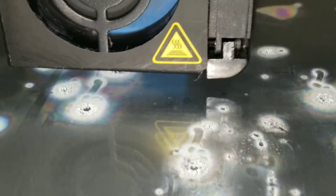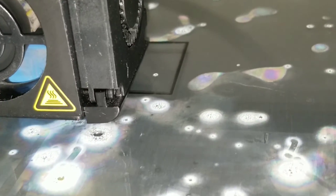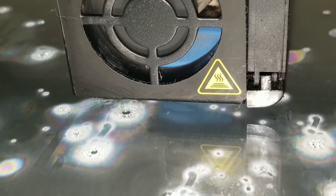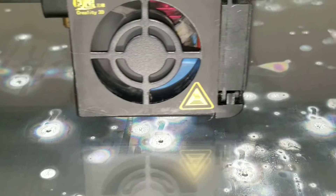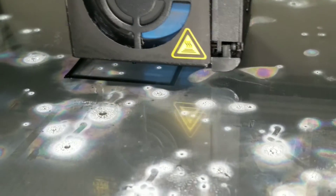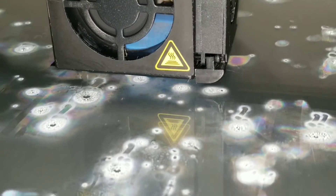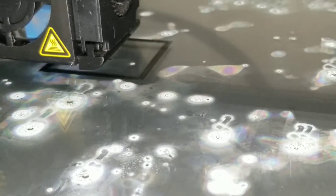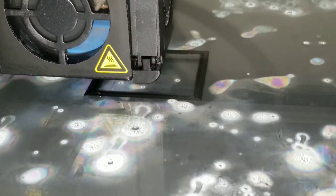As you can see it's printing that square out now. Towards the outer edges it's going to be even less squished. If you see nothing is coming out while it's printing, adjust the height. Here you can see the left is a little further — it's darker — so I need to adjust that side.